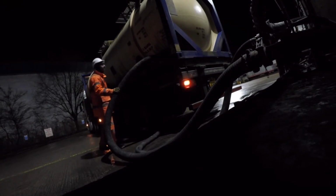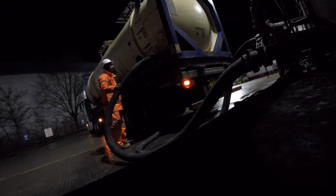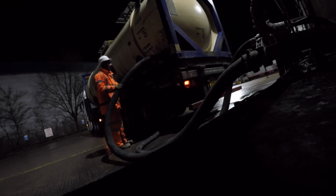That there, you can hear going off, that's the overpressure valve, so the tank's reached 2 bar of pressure now. Just confirming that it has reached 2 bar of pressure by checking the gauges, and I'm just opening up the vent valve slightly to vent some of the excess. You don't have to as such, but it kind of looks more professional because you're managing your pressure manually rather than relying on safety systems to do it. And after a little while of venting, it should shut off again.